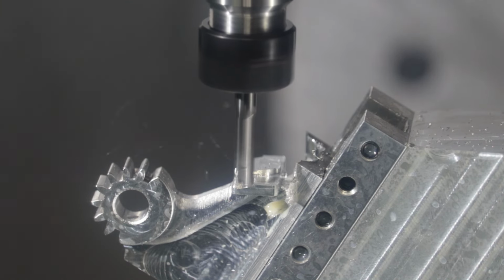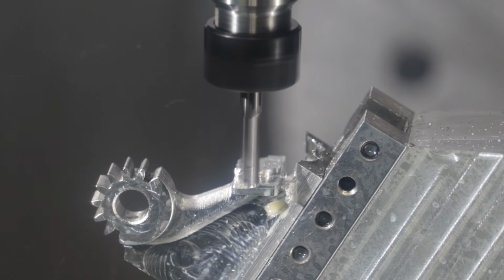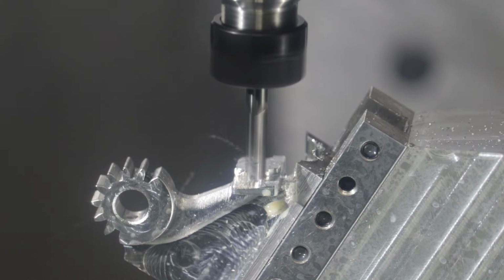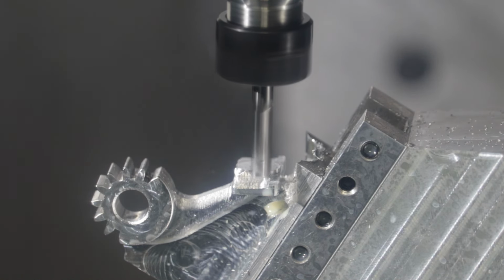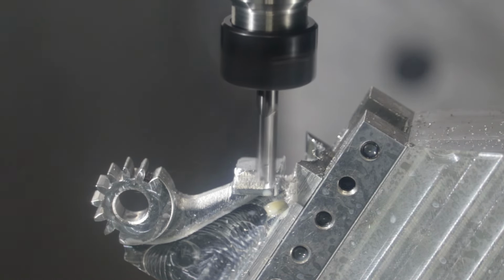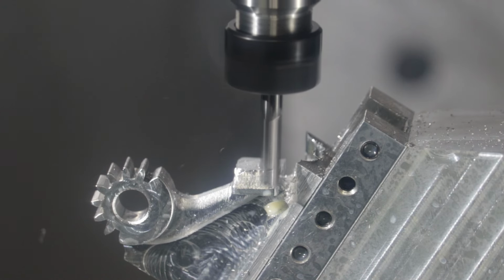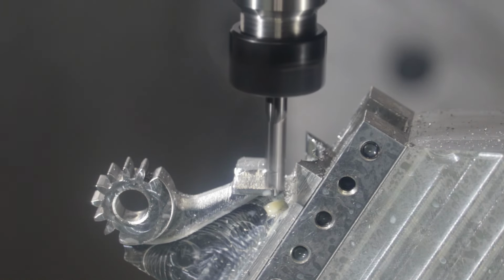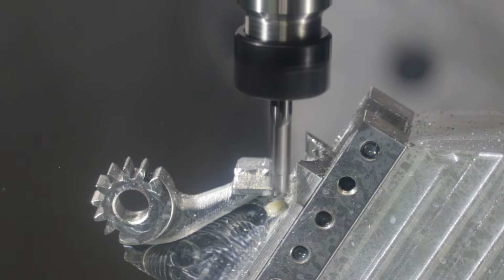Starting to get a little ring in the part, but it's not too bad. The face of our gripper pallet, or paddle, or whatever you want to call it, has a subtle arc across the face of it. And in the middle part where it's hopping up right there is where the serrated teeth are. We'll cut that next. Actually, I think we're going to do another 5-axis swarf cut to cut the 45-degree sides of these, not really knurls, but triangular tooth ridges.